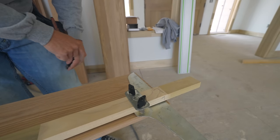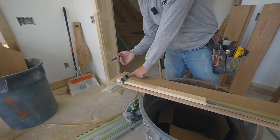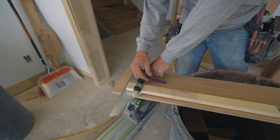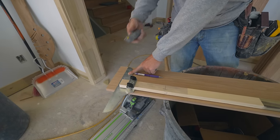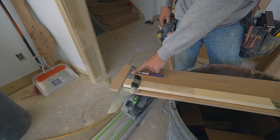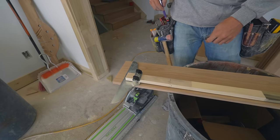Now, we're running our risers past our skirt board a quarter of an inch, so I need to account for that whenever I cut. I've already done about twenty of these risers on the lower flight. The process that works great for me is I use this little gauge block that I always carry around — it's exactly a quarter inch thick. Whenever I go to make my mark, I'll align my gauge block with the end of the riser, so that's nice and flush right there. You can see that quarter inch margin. I prefer to use a pencil line on white oak rather than a utility knife.